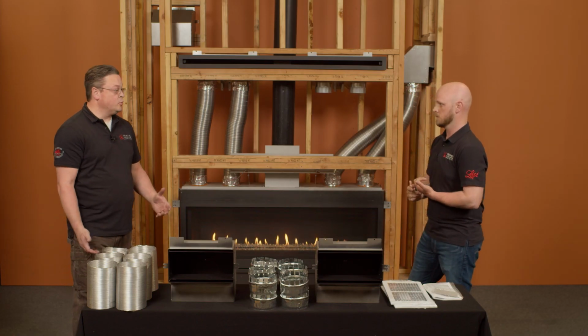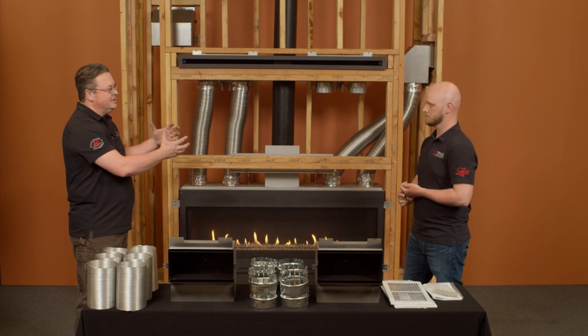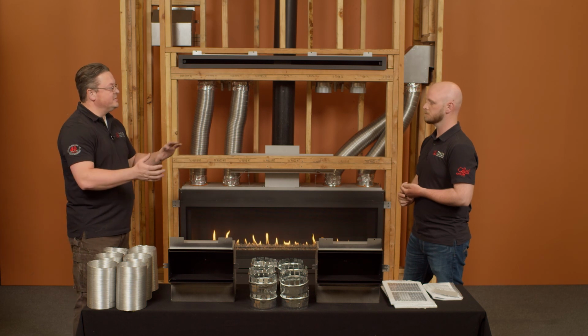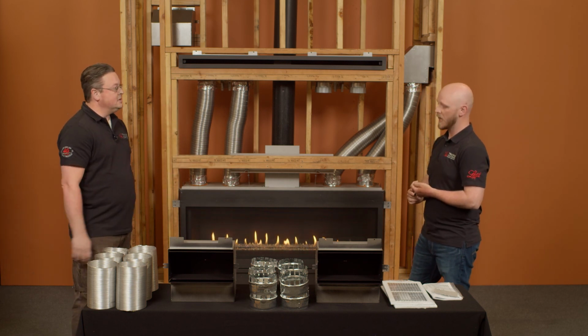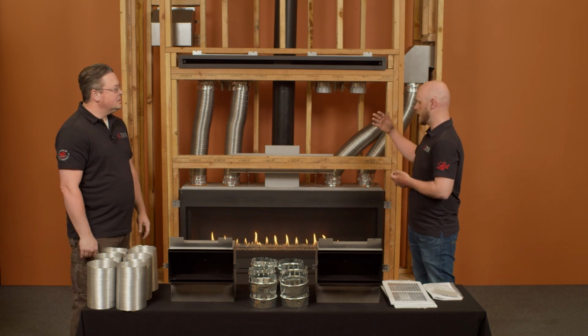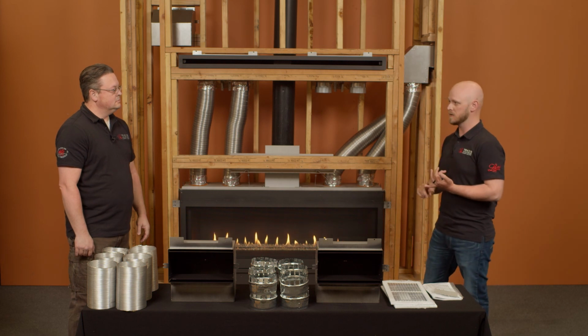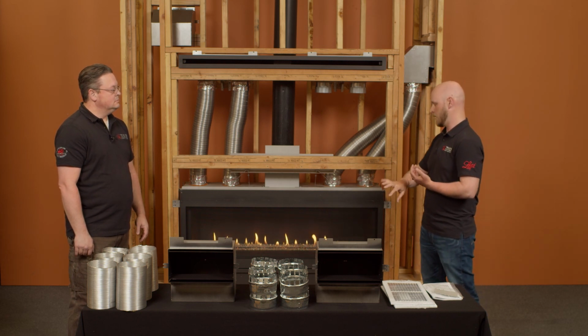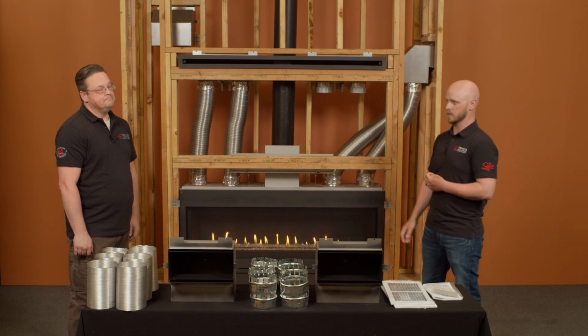So basically the same room. So if the fireplace was like a room divider, like an island, maybe between a living room and a dining room, the duct could be anywhere on that chase. Absolutely, but if it's a divider wall, say between a living room and a bedroom, the discharge must be in the same airspace. So if the fireplace is getting its convection air from the living room, the discharge must be in the living room as well.